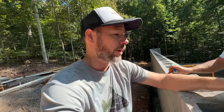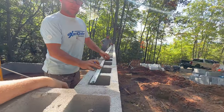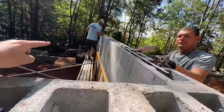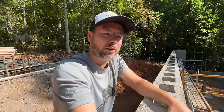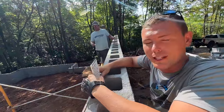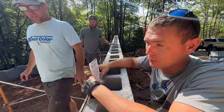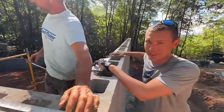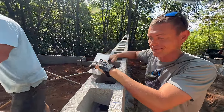We're going around the wall to mark where all the anchor bolts are going to go. The code is that there has to be an anchor bolt within one foot of the end of all plates and no more than five feet down the length of the plate in the field. We've seen foundations before where people put very short anchor bolts — like six-inch — then only fill the top core solid with some mud, so the anchor bolt is really only attached to one block. There's no solid core poured, so it could just pop that one block right off the rest of your foundation.